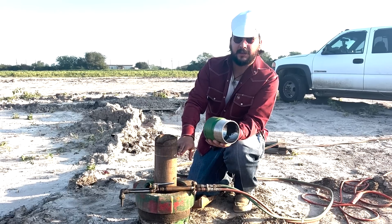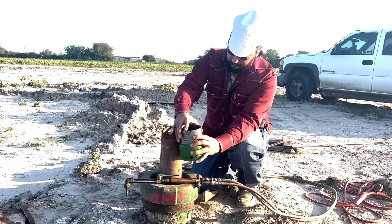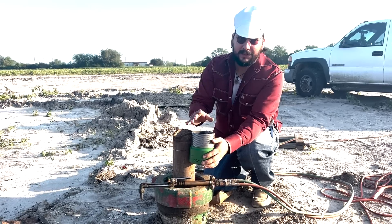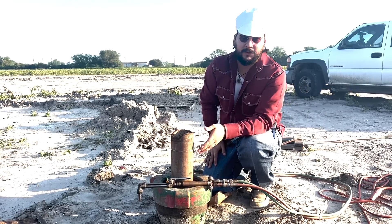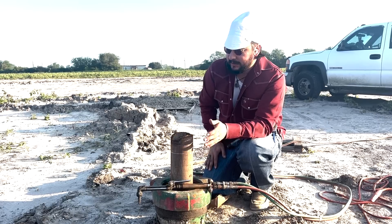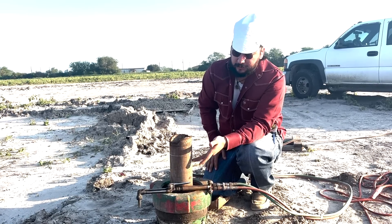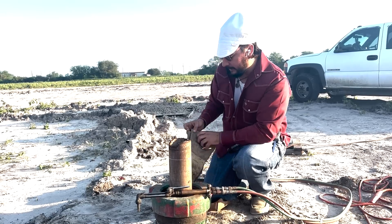We found where our cut's going to be, and this line right here is where I want my weld to be — sitting about right there, so I don't have a whole lot of space to weld this. Usually the gas company will give you a measurement of where they want you to have this thing cut. In this instance, the customer did not give me a specified measurement. They said put it as low as you possibly can and still be able to weld it. So I'm leaving myself a little bit of comfort room so I can make a nice, clean weld.